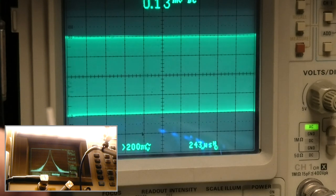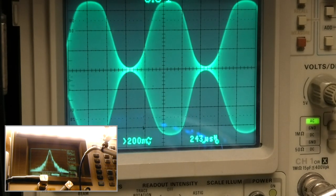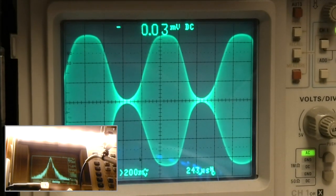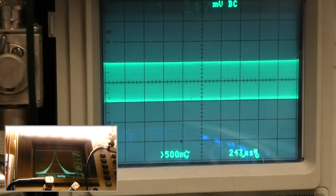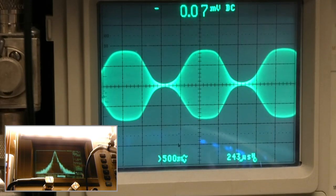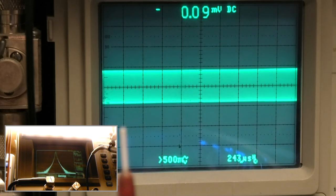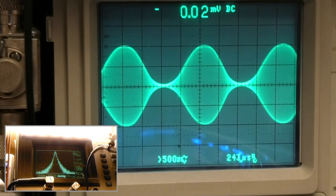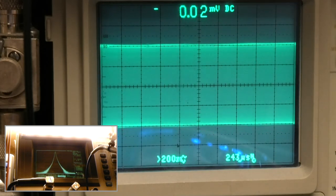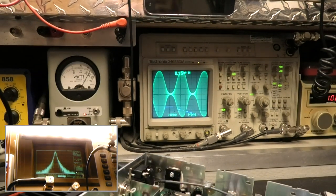Let's take it to 30. It'll take it. See it? That's not on the 20 megahertz, that's on the 400 megahertz. It's extremely accurate. Now let's take it here, one bar up, one bar down. See how it appears to be flat topping? Let's turn it back down, where it needs to be. Now we're back to normal again. And everything in relation to what we see on the spectrum analyzer.